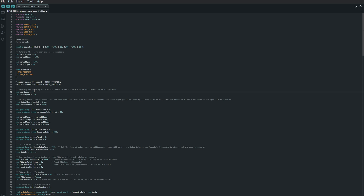Lastly, we have these two lines of code which control the servo speeds when the faceplate is opening and closing. Since my servos are pretty high torque they need to go at the fastest setting, which is 10. But if you're using servos like MG90S servos you might want to tune this down to either 8 or maybe even 5 when the helmet is closing or opening.